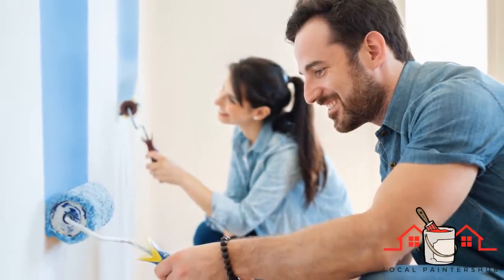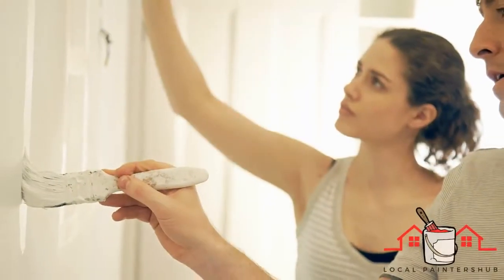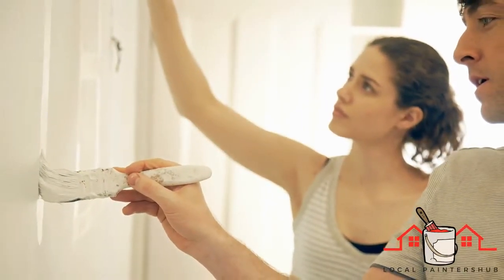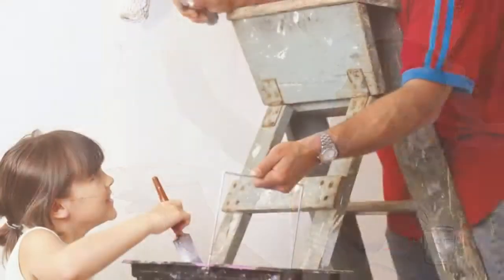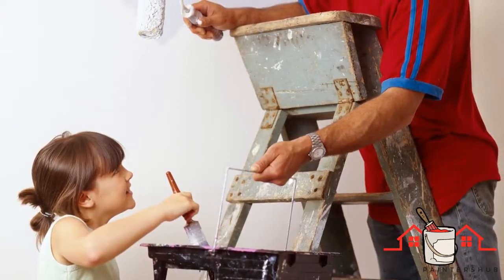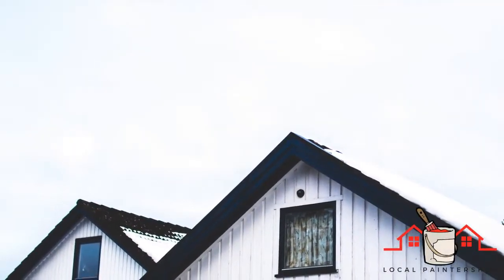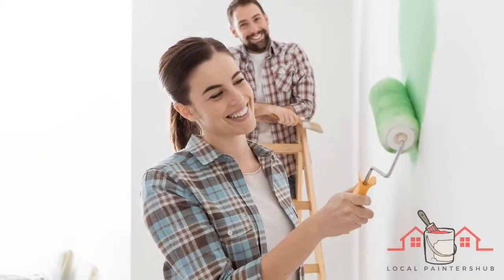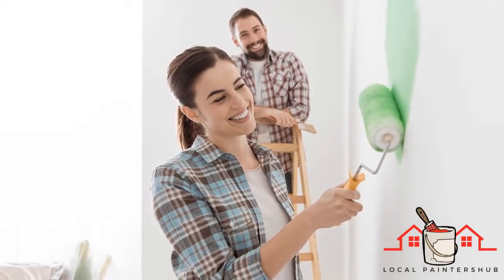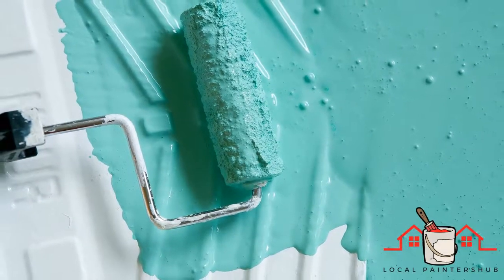And, if you are painting period or family homes with children, the likelihood of needing to do a quick wash of the walls with sugar soap and rinse off with water and a sponge is high. This will help to give a smoother finish to your interior wall painting, leaving your house paint jobs above the expectations of your clients. In the event that you need to fill any cracks or holes in the walls, make sure that you are only using the most suitable filler. Give your crack filler a chance to dry off before sanding down until smooth, then move on to paint the walls.